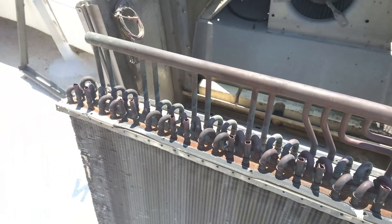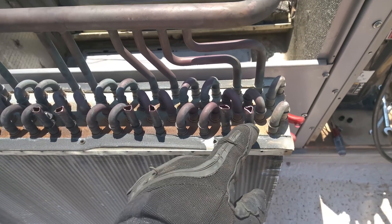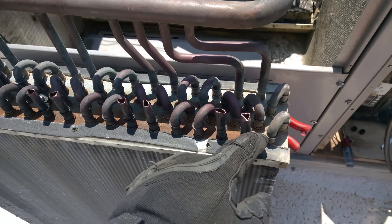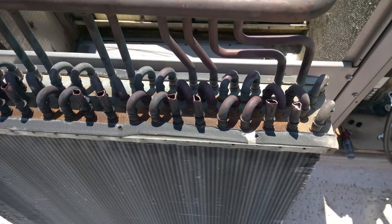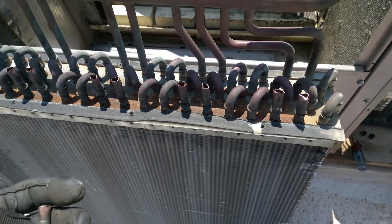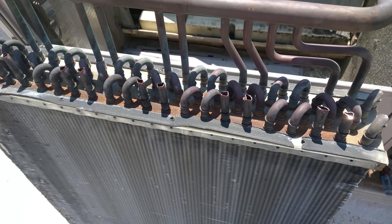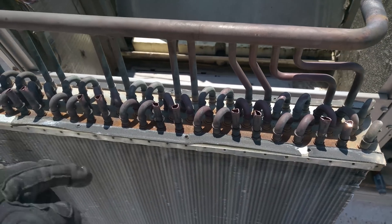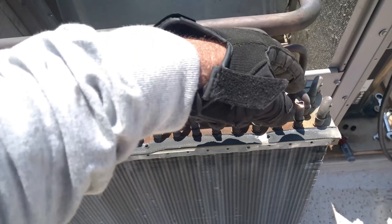Here's the manifold assembly cut off. Normally you'd be taking these off to replace them, but you have to take them off right here — each one of these little bell ends right here. These are so fragile when you pull them off; a lot of times they will break when you heat them up, break off flush with the bulk plate, and you're screwed. If you want to resurrect in an emergency, you've got to cut back and get into the coil. So it's good to cut these back and join it right there anyway. Even if you're going to put another manifold assembly back on, you could fix those up all level and put couplers on or swedge one in.